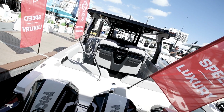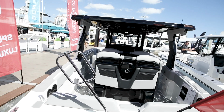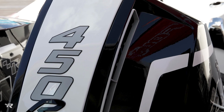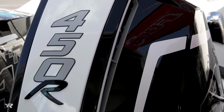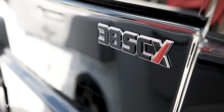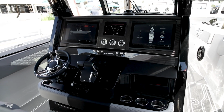That being the case, these engines have our Max 5s, and they're spinning in, which for a triple engine setup is pretty common. I would suspect with the 5 blades generating so much stern lift, they like spinning in to get a little bit more bow lift out of the boat. Yeah, but it's been super fast for them. I know they're approaching triple digits with some of these 38s.